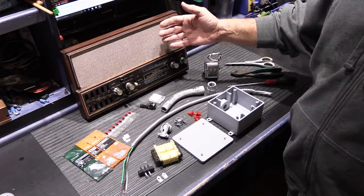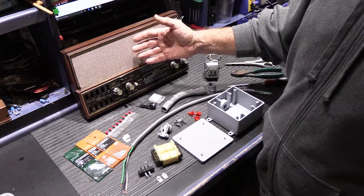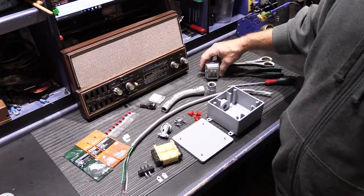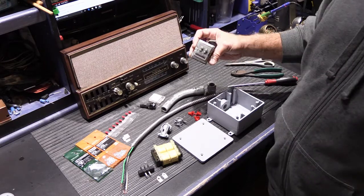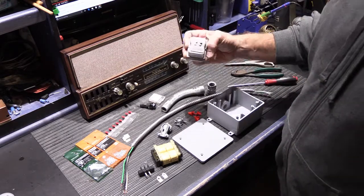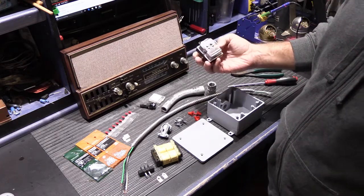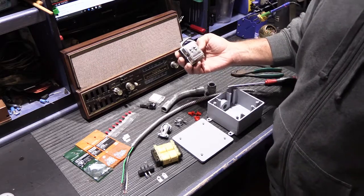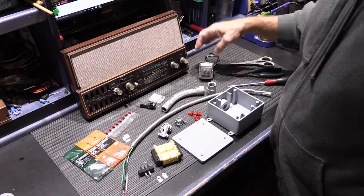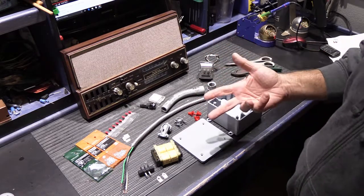Models like the 2540, 2090, and 2063, which came out in the mid or late 1960s and were in production through the early 1970s, use a fairly unique Nutone transformer rated at 30 volts at 20 watts. These are the only intercom models Nutone made with that transformer, and they are of course no longer available — they haven't been available for probably over 20 years. A 30 volt transformer is a rather odd item today; it's easy to find 16, 18, or 24 volt transformers, but not 30 volt.